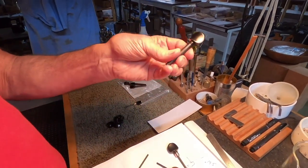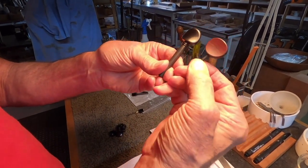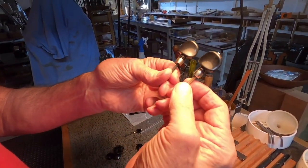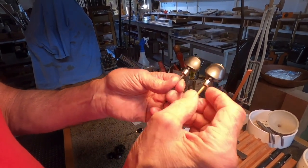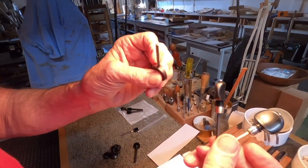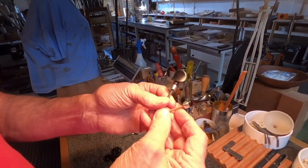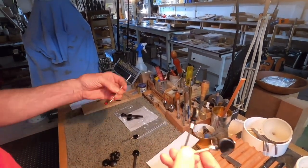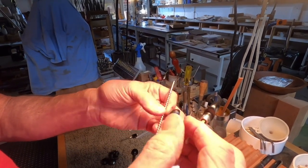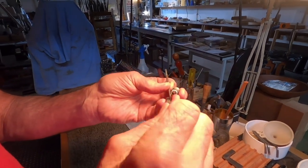So I decided I'd try and figure out how to convert this to a better revision of this kind of idea. And so here's a couple of first prototypes or tests, and I'm pretty happy with them. I bought some nickel silver to make the ferrules. Of course, that'll keep them from splitting, unlike the original design, which doesn't have any provision for that. And I just broached straight through with an 1/8-inch hexagonal broach to make a nice hole for the Allen wrench. Whereas on this one, I just figured out how to drill the right size hole and pressed it in and crossed my fingers that it wouldn't split.